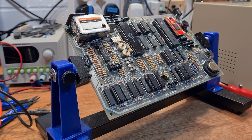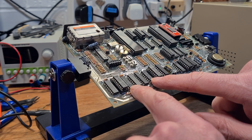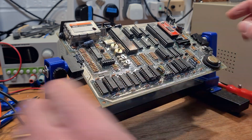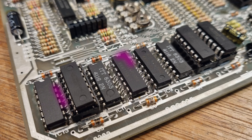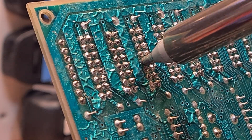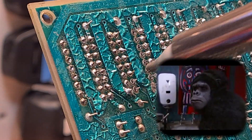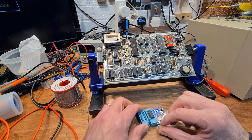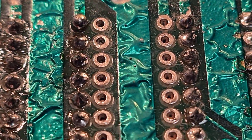The three socketed chips have been pulled out and tested in the chip tester gadget and are working as expected. If you look a little closer, the chips not socketed don't appear to be matching. These two here are the same, and these two here are also the same — this one is odd. This means at least six of these chips have been removed at some point, with only three being replaced with sockets. The first one was removed and tested fine, with no damage under it — maybe it's an original chip.